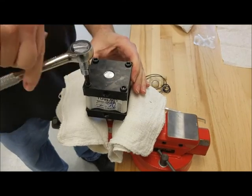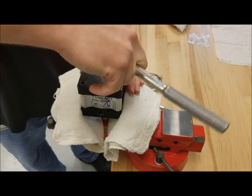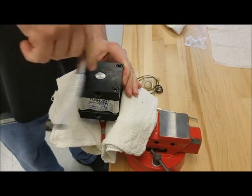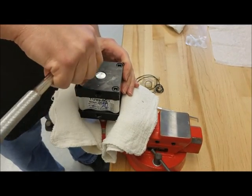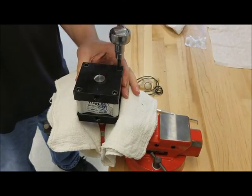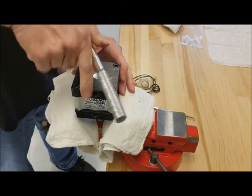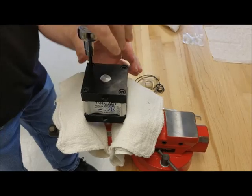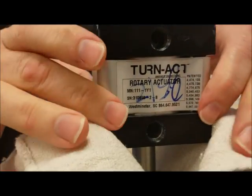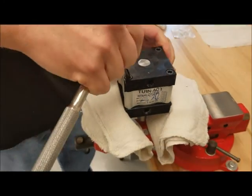And you'll want to not tighten any one bolt first. You want to start taking them down in a pattern cross corner. Now on single vane it's a little trickier. Once you get it to start tightening down, you want to make sure you're not pinching the tube between the head and the other head. So make sure that as you're tightening down, your gaps on the sides here are even. And if you feel any resistance at any point, you want to make sure you stop and back off.